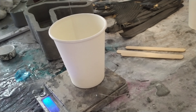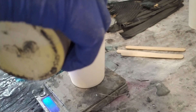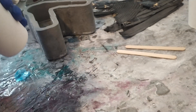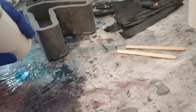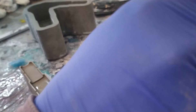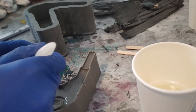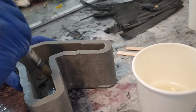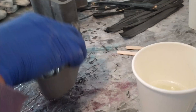I'm going to measure and mix the resin. There's more than enough here, but this stuff is really quite hard to fully saturate, so you're just going to end up using a lot of resin. I mix up far more than I need and just expect it to all squish out, but I'd rather there be more than less for these parts. I'll start by laying down a nice even coat of resin over all of the final surfaces of the part, getting into all the nooks and crannies and making sure there are no little bubbles collecting, because we want to start off on the right foot.